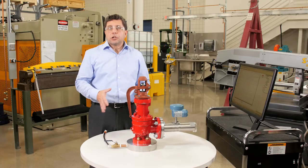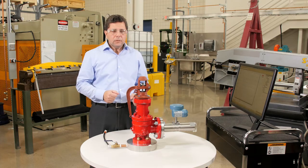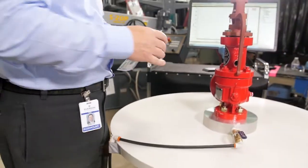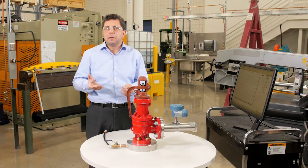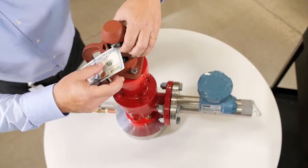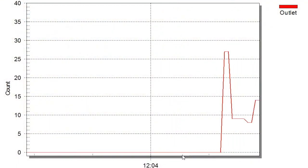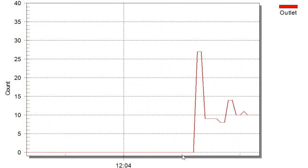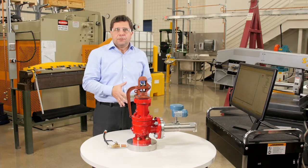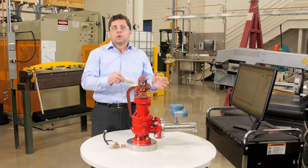Now, after a release occurs, the chance is very high that the valve will misseat, causing leakage. So let's simulate a leakage — I'm going to block this valve using the thickness of a hundred dollar bill, which is 0.1 millimeter or 0.004 of an inch. See how the red graph is showing the 708 output detecting constant leakage, indicating the valve has misseated. If you were using process information, you wouldn't have been able to detect this leakage because the process would compensate for it.